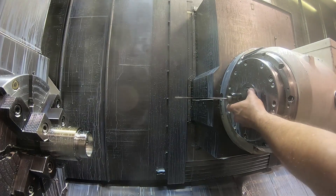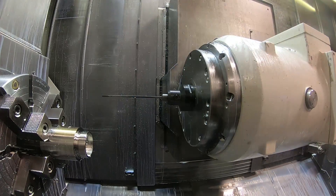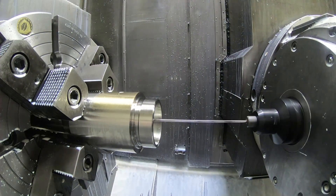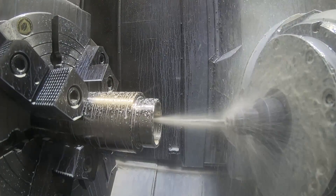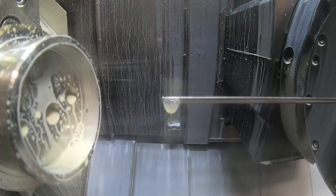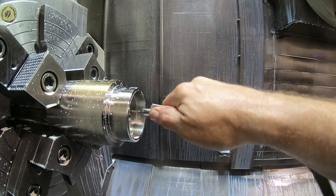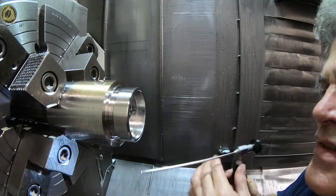And here's the first gun drill. Now I wasn't real happy with the tip of this gun drill when I put it in there, but I said it'll probably work. And this is kind of a mistake to think in these terms when you're machining something. If you think something's not going to work, you should stop and change it. If you watch carefully and listen, and look at the way the coolant's coming out of that hole — you can see the minute it changes right there. You could hear it if you listen carefully. And that's when it broke the tip of that gun drill — it just broke it off. Gun drills are kind of nice because you can almost always get what remains in the hole out of there. With a twist drill this might be very difficult; if it's a carbide twist drill, it might be impossible. But it turns out that the coolant blew the tip of that gun drill out of there.